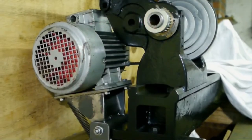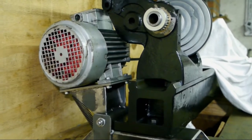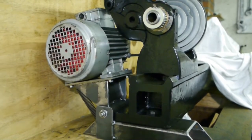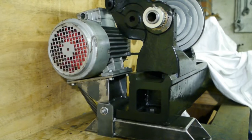Here is the motor mount I made for this old lathe. I'm almost ready for testing — the last thing I need to do is hook up the electrics to my variable frequency drive. What we've got here is a one horsepower, 940 RPM motor that came out of a chicken barn where it was used for ventilation. It was dirty as hell, so I cleaned it up as best I could and made a pulley for it.